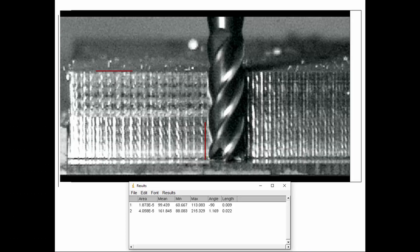An interesting analysis you can do is subtracting the prior frame from the current frame of the video — a really simple motion detection technique used in machine vision. What we can see more clearly is the things that are moving in the frame: the end mill spinning, chips flying out, and the workpiece shifting up and down. I also made markers in the video and advanced a few frames to find the maximum deflection distance. Taking that into ImageJ — a scientific image analysis program — I calibrated everything and measured: the workpiece moved down about nine thousandths of an inch and the end mill moved backwards twenty-two thousandths of an inch.